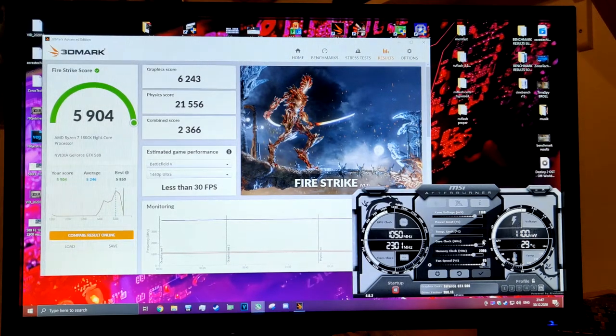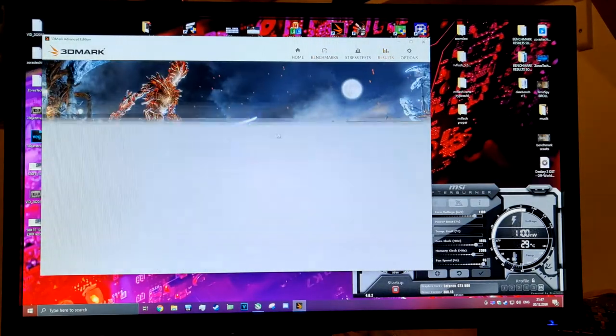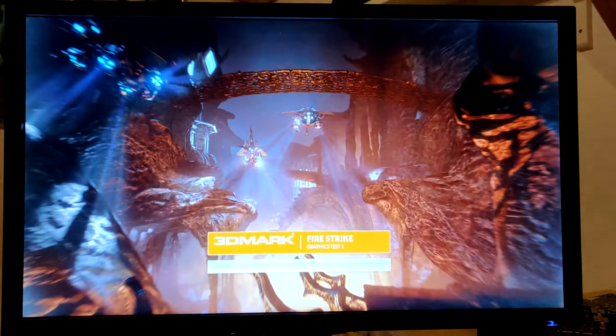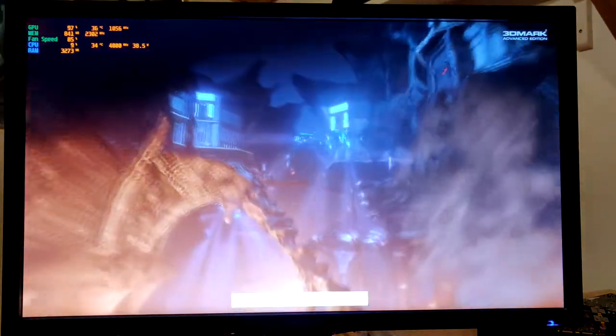Okay. But let's go in small steps, because this is where it really stops. In my experience, GTX 580s in the 1.2 to 1.3 volts range, the GF110s, which is the GPU that 580s are based around, start topping out at 1020 to 1060. This is one of my better GPUs, which is why it's running 1050 right now. Though as I've said, it didn't pass before. This is probably just because of the cold. But, well, yeah, this is the second best GPU that I have.